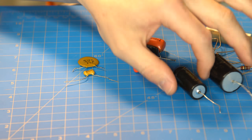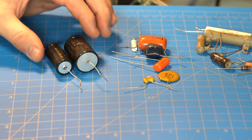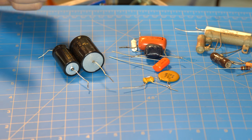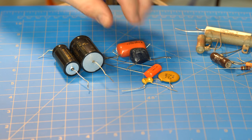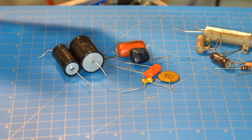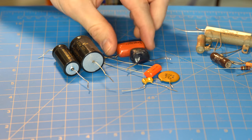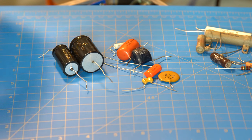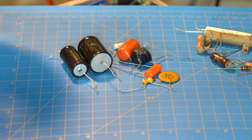One final note: recently I've seen a new style of large film-type capacitors — similar to metal film — that can get upwards of 40 or 60 microfarads, but they cost almost double, around $10 to $14 instead of $5 to $10. I'm going to try that in a future build. The good thing about those is they don't age — they don't die. They will last almost indefinitely under normal use within specs, unless overloaded.